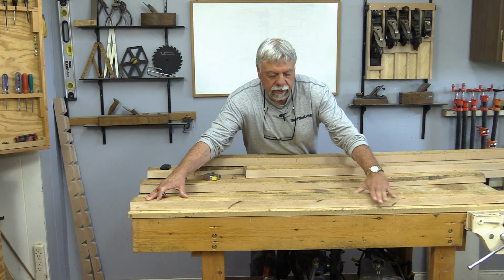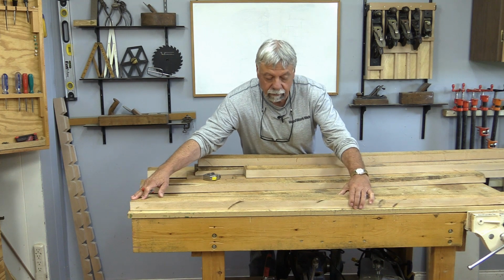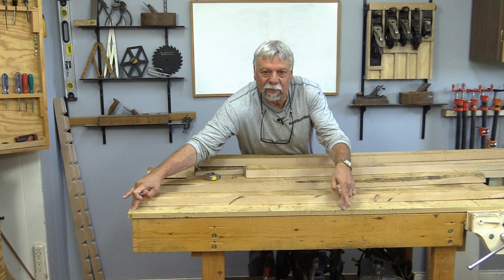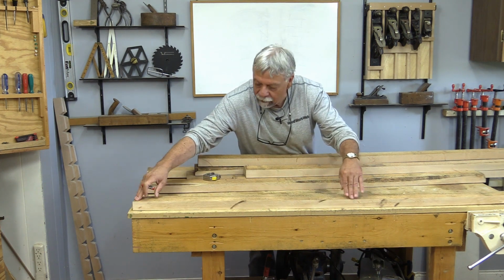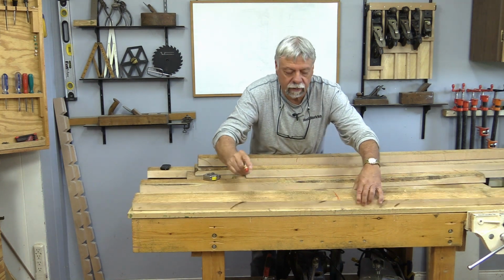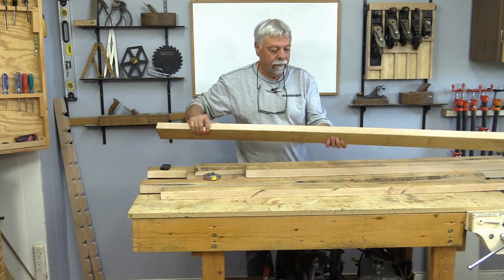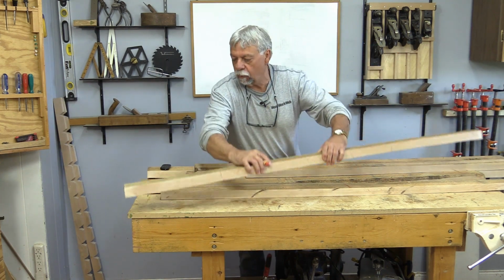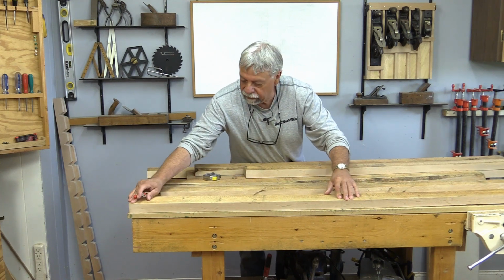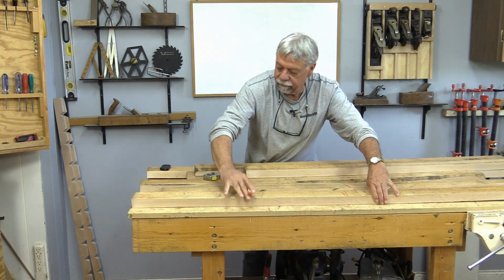Now before I go to the jointer, what I need to do now is go through the individual boards and I'll cut them sort of one at a time, but I need to find one, happens to be where this black spot is on the workbench here, but they need to be flat from here to roughly around here. So I'm just going to mark them and I'll go through each one of them individually and we'll look at them and determine which ones are the best ones, and then we'll take that. You can see how badly that one's warped too. That looks good to right about there as well.